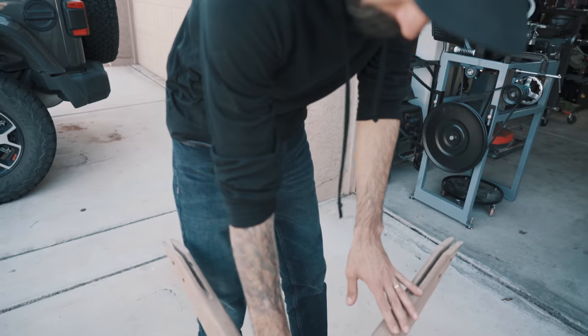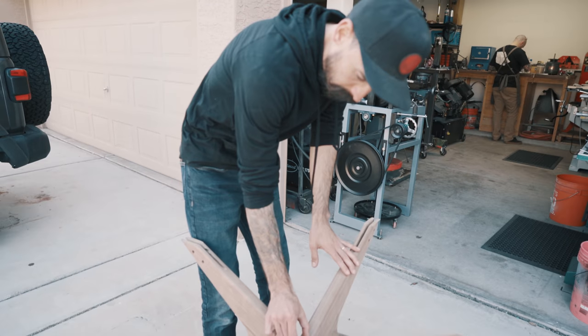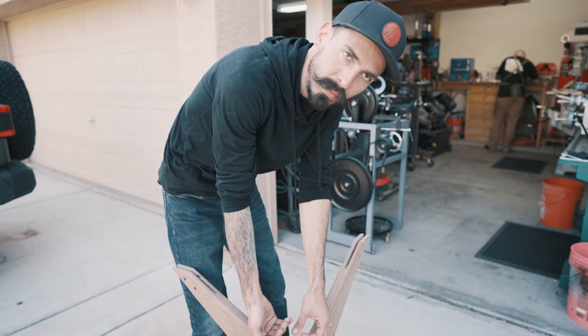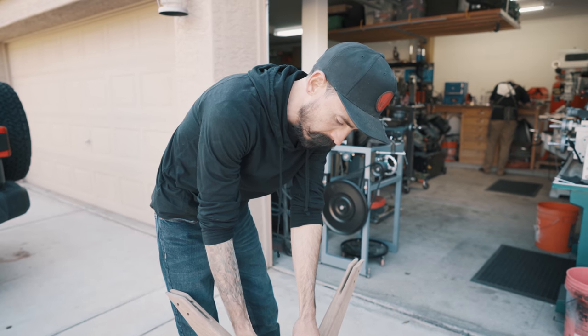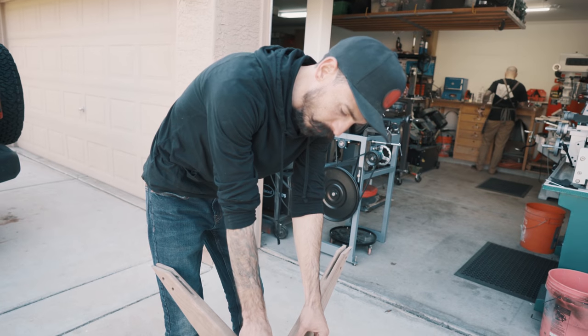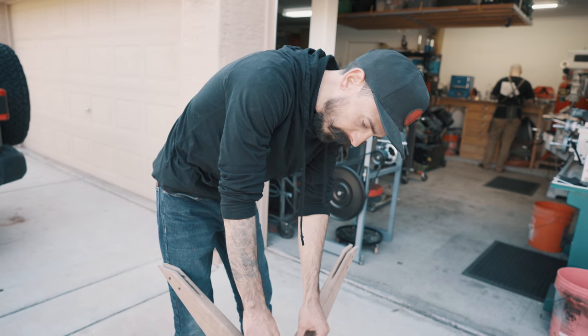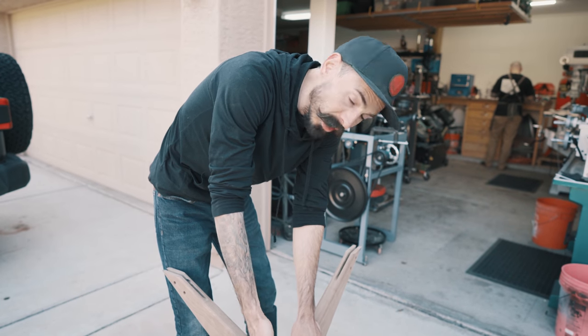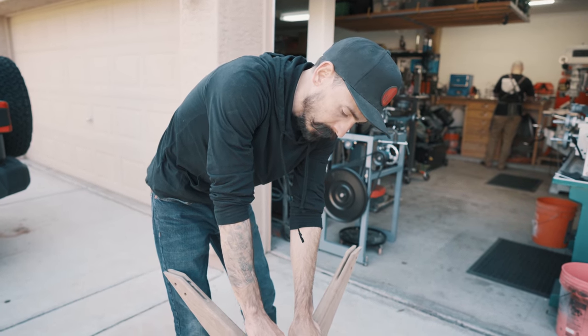What he's making right now is going to be an aluminum block that's essentially going to be a U shape, like a U channel, but the inner parts are going to taper. That way when we put it in here and push it down, it wedges in and makes this joint really tight, and it's adjustable. That's the whole point.